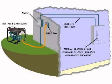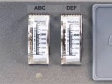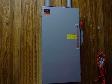Fourth, you can completely replace the standard main breaker panel with a similar transfer panel. Due to the labor involved in disconnecting and replacing the existing main breaker panel, this option is more attractive for new construction or when an existing service is being upgraded. In all four options, the transfer device will consist of a utility breaker handle interlocked with a generator breaker — only one of them can be turned on at the same time.